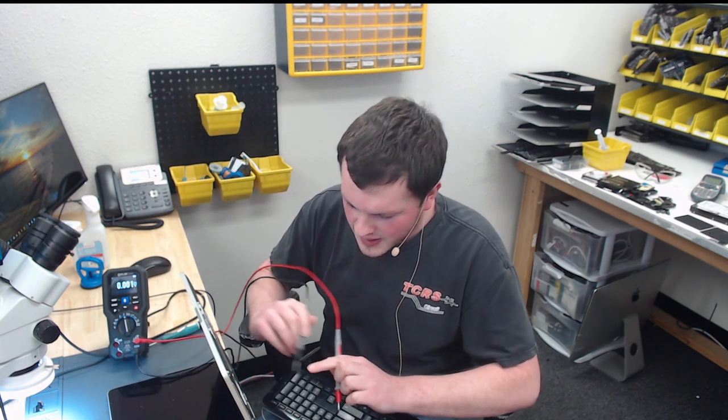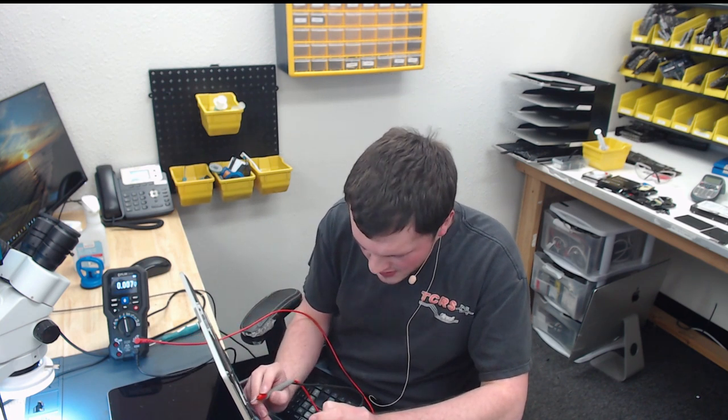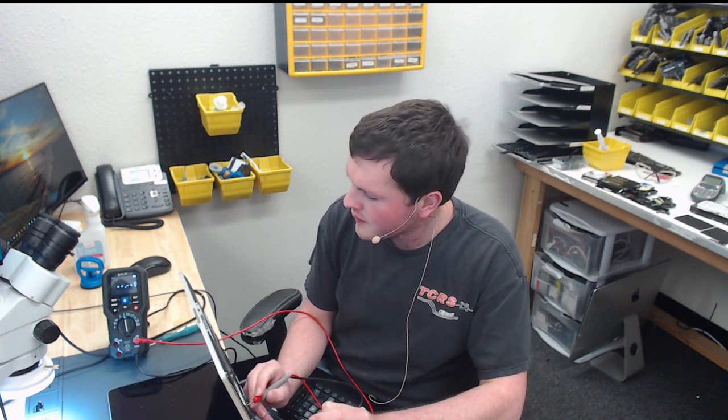The first thing we're going to check is PPBus G3HOT. Pay close attention to what the meter does when we measure on the coil. I can kind of hear pulsing right over here, so I'm going to check PPBus. Notice that pattern — see how the meter is cycling back and forth? Most likely what's going on, PPBus is cycling too fast for the meter to pick up, and we see the cycle at the same time we see the click.